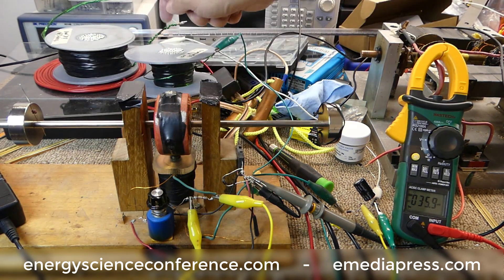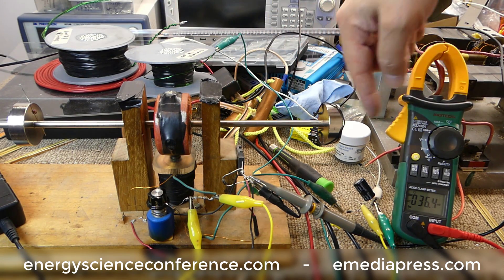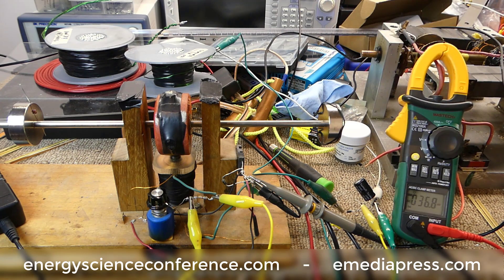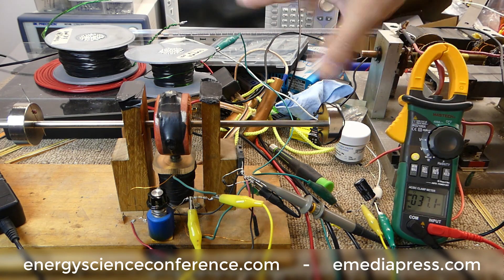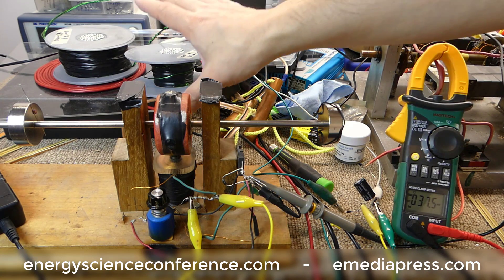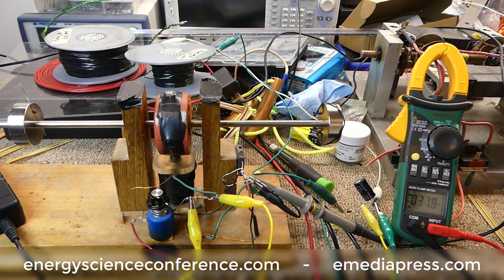The magnet is going to induce current in the coil, create a magnetic field. It's going to pulse off and on and that's going to come into the capacitor. One lead of the coil goes to the negative of the capacitor, the other goes through a diode to keep it unidirectional — that keeps it DC so we only receive one polarity to charge the cap. The other two leads on the capacitor go to this voltmeter, which is stating 38 millivolts.